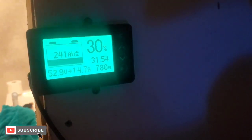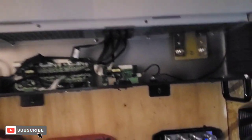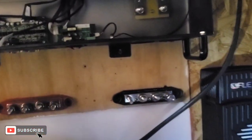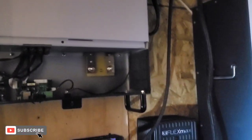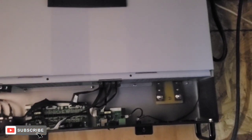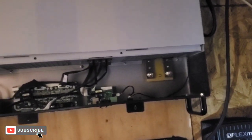I had charged the other day so that's why they're pretty low right now. I've been keeping them low because I've been trying to figure out how to get my panels up. I also burnt out the MPP Solar inverter — I was bringing in too many volts on the solar side and it just started smoking. I already bought two EG4 inverters and they're on the way. I'll be installing them in series because it's only 120V output on the EG4 inverter, so I'm gonna double mine up.